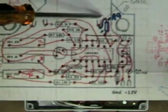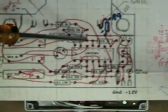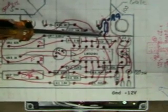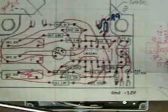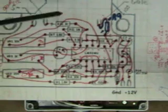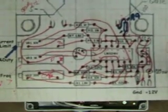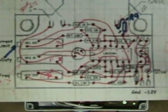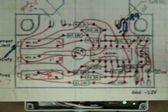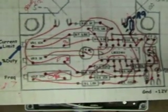R9 is one that you will remove and tie into this lead right here for your gate, which goes over to the driver board. I'm leaving this up a little bit so you can get a good look at it and know what's going on. You can blow this up if needed — very, very simple to do, not hard at all.